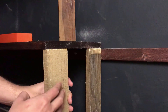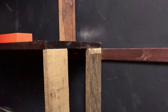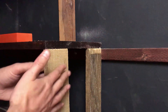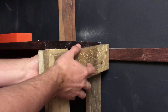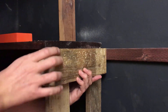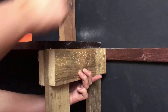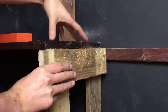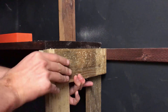Because I've got these shorter pieces of wood for the shelves, I want to make sure they're well supported as I move across the wall. So I'm working with these pieces of wood right here, and of course all this wood is going to be stained so it matches the shelves. I want to be able to put the edge of this board on one of these pieces of wood that goes all the way down to the other piece of wood, and I want to take pieces of wood and do this — these will get nailed together as one piece. That way I can take nails and drive them down as well, and it should produce a really solid fixture on this side.